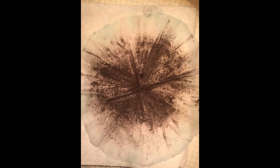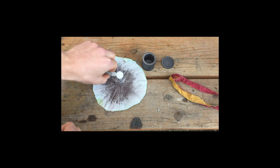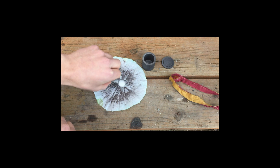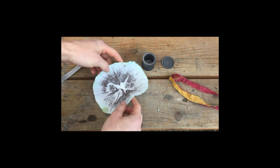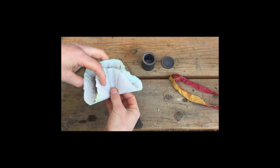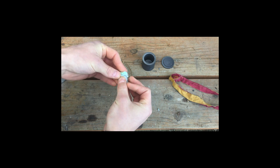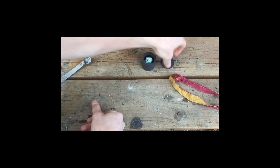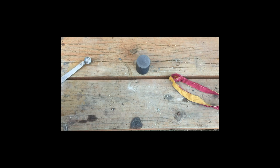Back to the project though. Here you can see that there really isn't much silver in the filter paper, and the next step is to get the silver to melt and coalesce into a single bead. I added some borax flux to the filter paper and folded it up. I then placed it in a small graphite crucible and added the lid. The small lid was removed mid-sintering to allow the filter paper to be burned away completely.